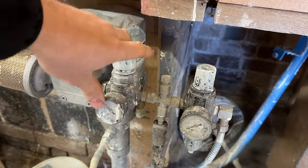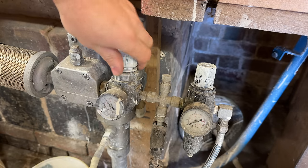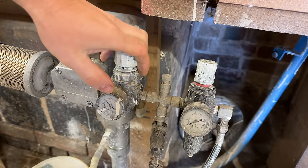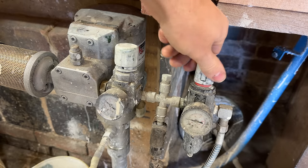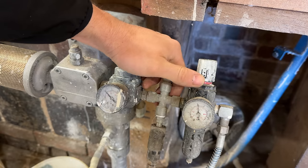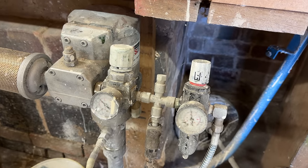Settings for spraying. This is real world, this isn't your showroom bit of kit, but this is a grafter, it's done years. I tend to keep the pump pressure quite low, so it's coming through the tip and atomising, but you're getting heavy tails. Then I put plenty of air assist pressure on, so if you trigger it and look at your pressures, when it's triggered I tend to run about 30 psi, and when it's not triggered it shows about 42 or so. That's where I sit with my gun pressures. You should get a fairly nice little spray pattern like that, which works well for me.